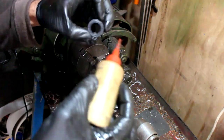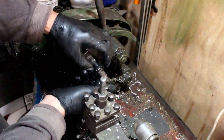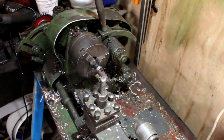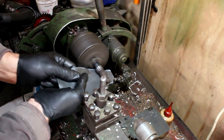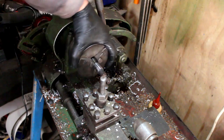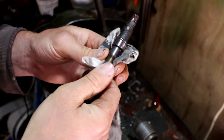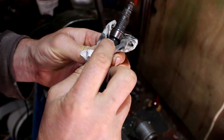I'll just see how well the seal fits in there. Yeah, that's perfect — it's snug but it's not too tight. So I'll get that off and clean up the surface with some sandpaper just to get it nice and smooth so it doesn't cut the seal up. I think that's pretty good. That seal is still nice and snug, so I think I'll leave it at that. That looks pretty good to me. That groove isn't really needed, so I won't worry about cleaning that out — I'll just knock that bit of splatter off.